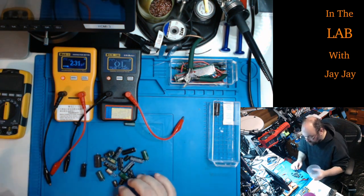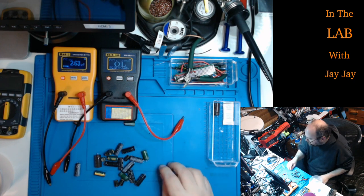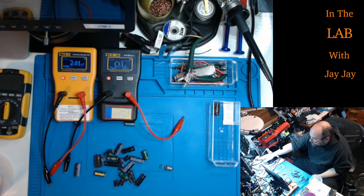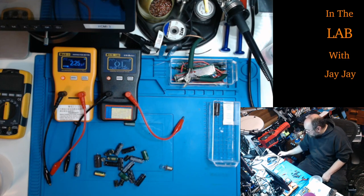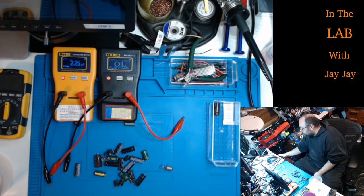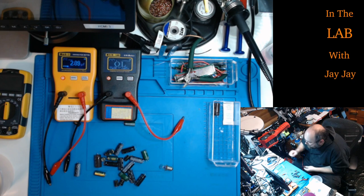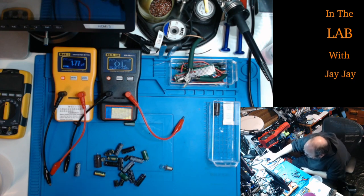and not dead caps. Now, we've got a light globe in there. I'm pretty sure this didn't work. I'll tell you what, let's just quickly put a couple of volts through him and see if he's actually dead or just playing dead. So we're going to need, let's say, okay, so the output's set at 2.4 volts. That's not really high, so that's probably okay. You could probably put 2 volts, 2.5 volts into a globe. Let's give him a go.